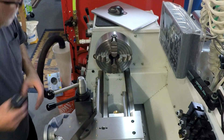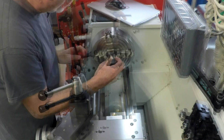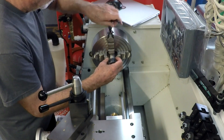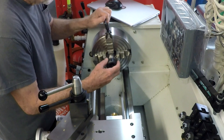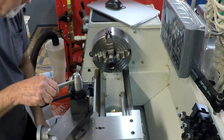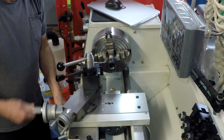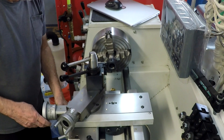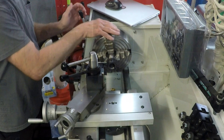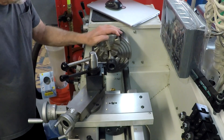The camera uses a six millimeter mounting pin, so I'm going to have to use my ER32 adapter in the lathe chuck. Once I get the adapter dialed in, I'll use an ER32 six millimeter collet and a six millimeter gauge pin to do the next alignment.